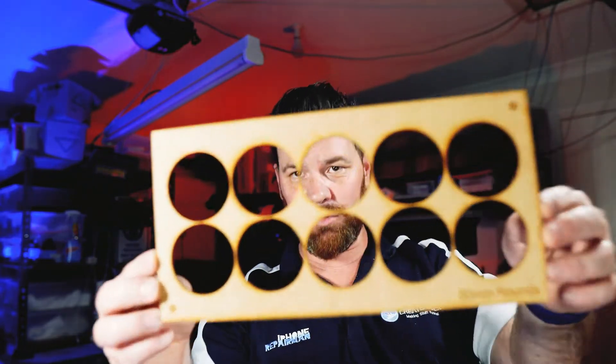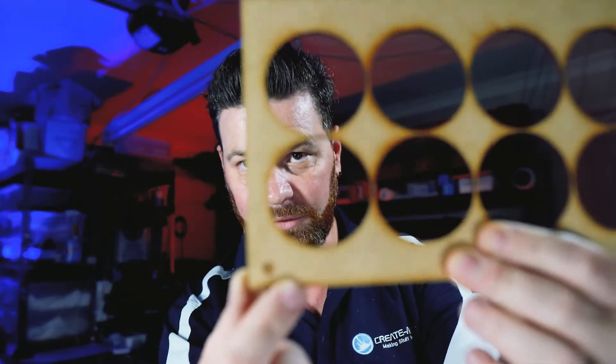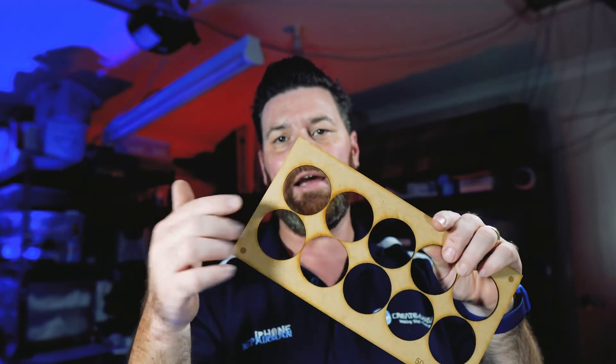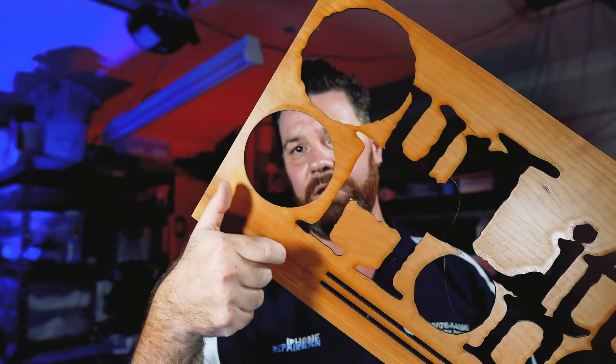Another thing I like to do with this laser is make up little boards like this one. We put the name of what type of board it is on there, and we put a couple of little dots in the corners. That way we can use those registration marks — just throw this bit of board in there, it registers where it is, then throw in the little cut-out rings or discs we're using, and drop our design straight on top of it. It always lines up perfectly. That camera registration system is a really cool feature of the Fusion Pro.